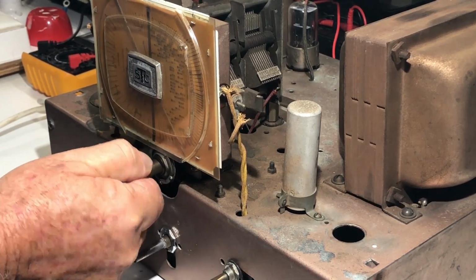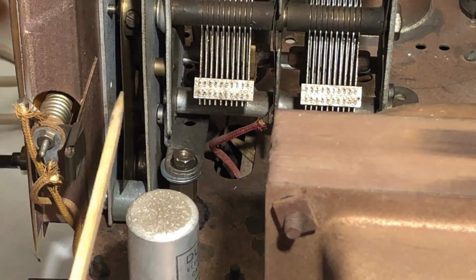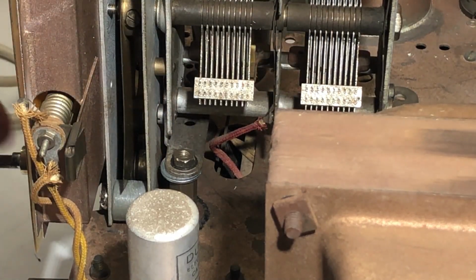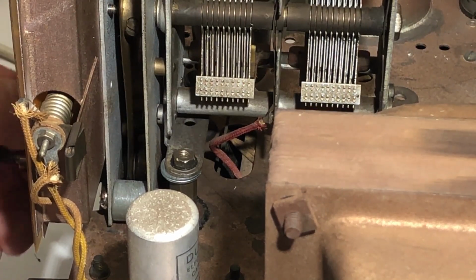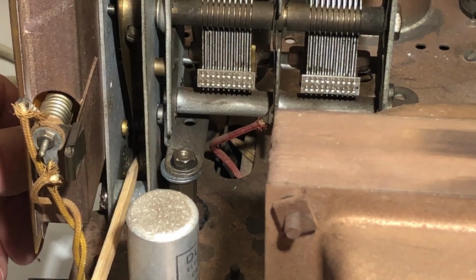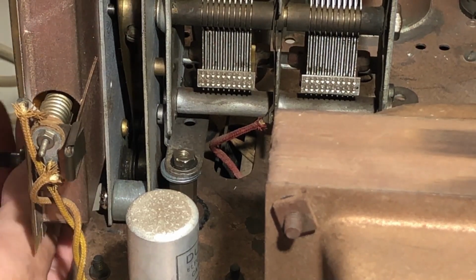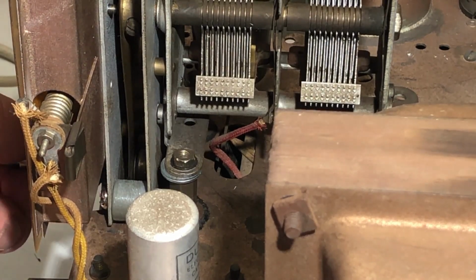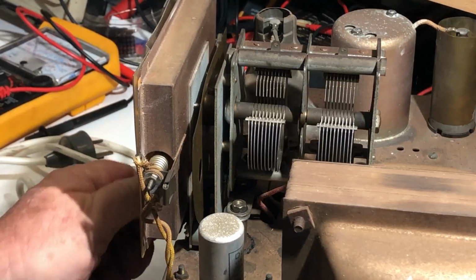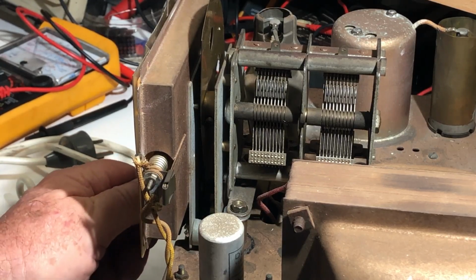And I think I've found what he was talking about here. Okay, so the spindle, which is this piece in here, runs directly on the edge of this brass disc here, and it reaches the end of its travel before the gang is completely closed, or just when it's completely closed. That has just dropped off the drive pulley here, so turning it back the other way, it won't go back. You need to sort of help it along a little bit. There we go. Now that will turn all the way around, and it should be a simple enough matter to adjust that. Just turn it around a little bit so that it doesn't run out of travel before it closes.